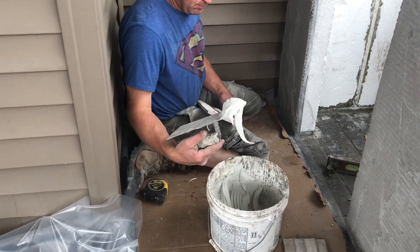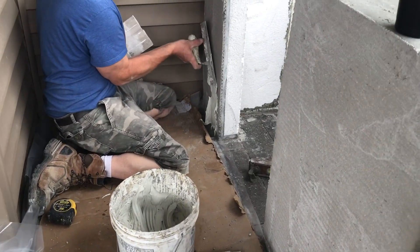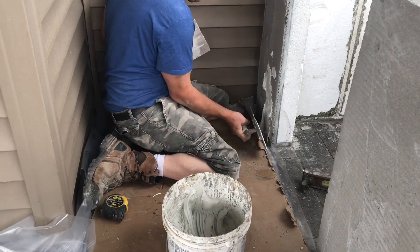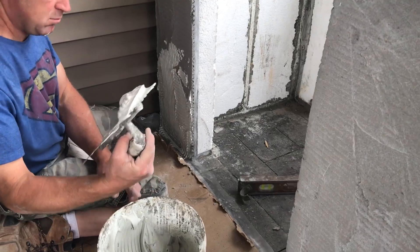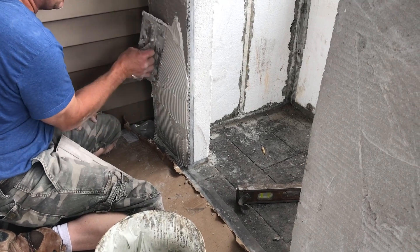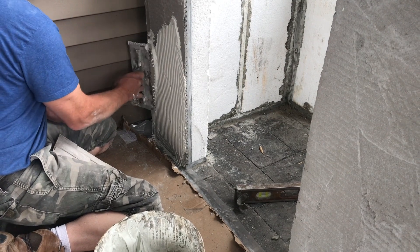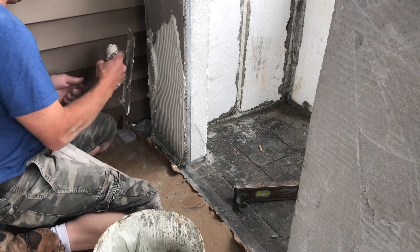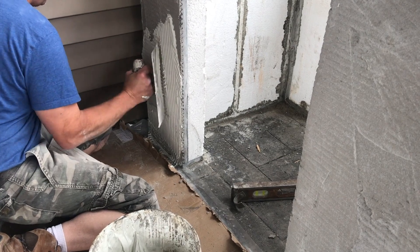Thinset is being applied for the installation of the stone tile that the customer has chosen. The stone tile has been cut and the first pieces are being installed. This is going to be the most time-consuming part of this project. This long step is not necessary if you are using the standard precast stone panels shown in our other kitchen builds.